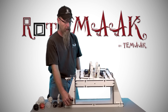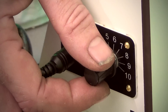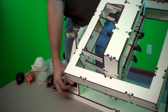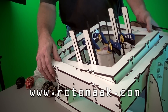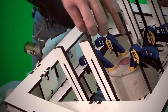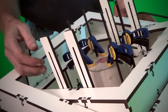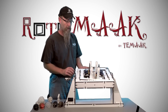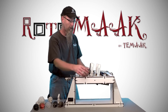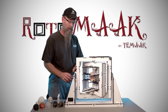It's fully variable speed. Different molds are going to take different speeds, and it'll take a little trial and error on each individual mold. The saddle we have designed is fully adjustable to allow you to center the weight of your mold on both axes. This saddle will slide up and down to accommodate virtually any size of mold and weight. We have precision 608 bearings on all places that need to turn, so it's very smooth spinning with long life.